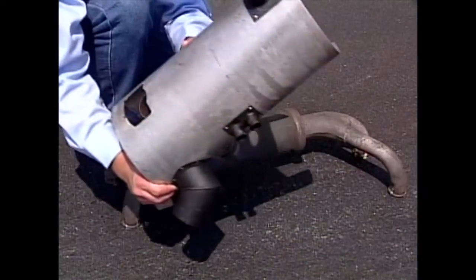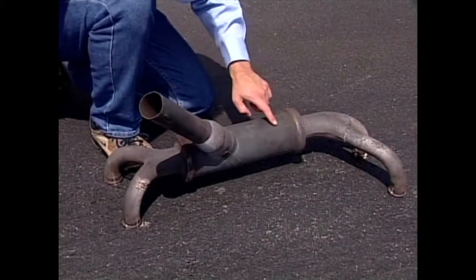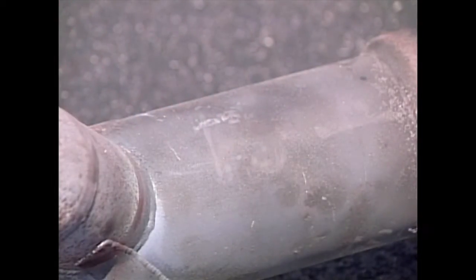Now that everything going into the engine has been checked, the inspection moves on to what's coming out. The muffler shroud is removed, and the entire exhaust system is inspected for leaks and overall condition. Exhaust leaks can be extremely dangerous in flight, so this is a very critical area. The oil system is checked, and the engine case and hoses are inspected. Most flexible hoses have a finite life, and it's very important to have them checked and replaced on a regular basis. If any of your plane's hoses are more than 5 years old, it's probably time to get them changed.